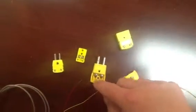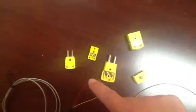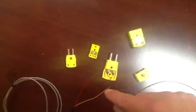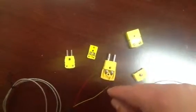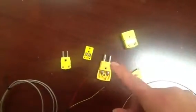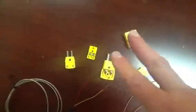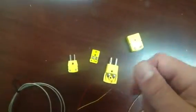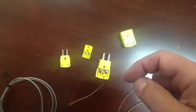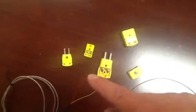That's a negative sign and a positive sign. On a thermocouple, which is different than almost every other electrical connection that you'll make, red is always negative. So red goes to negative here, and in this case yellow goes to positive. For a J-type thermocouple, the white would go to positive and the red would be negative. You need that to be consistent on all your connections. Red is negative for a thermocouple, and if you have them swapped the other way around, when you actually plug it in and heat it up, as opposed to the temperature going up, the temperature would actually go down — which is a quick indicator that you've got it wired wrong. If that's the case, just make sure that all of your connections have the red going to negative.